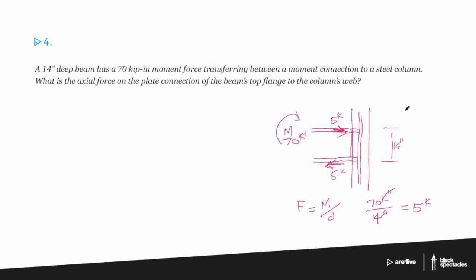Well, and actually it's a little different these days than it used to be. It used to be that you would say, all right, we'll figure this out, and then we're going to add X percentage as a factor of safety. Now it's a little more tuned to the actual situation. If you have a situation where you don't need that much extra factor of safety, then that number gets a little lower, so we can make these things a little more efficient. And in situations where we're really worried about it, we have a bigger factor of safety on it.